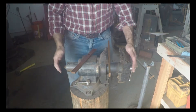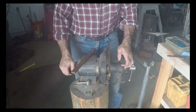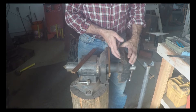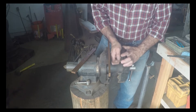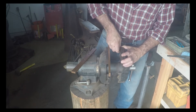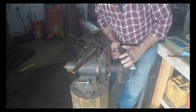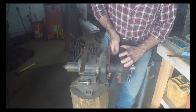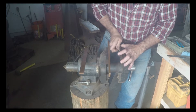What we have here is a simple five inch machinist vise. You can buy these at any hardware store or big box home improvement store. The only thing that's really important is that it has removable jaws. These jaws are just held in by a couple of screws. This is the stock jaw, and this is my replacement jaw — this is what we use to get our blades straight. We manufacture a couple of new jaws out of these one by three-eighths inch copper bars. Some guys may use aluminum, some guys use copper. What you want is something that dissipates heat fast.